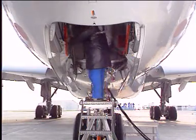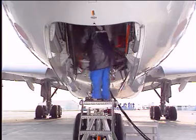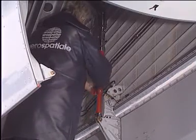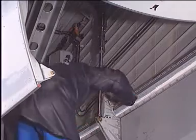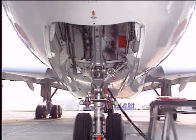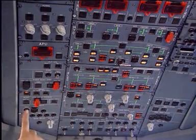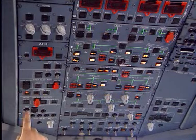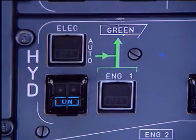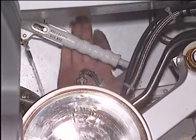Remove the safety sleeves from the door actuators. Make certain that the doors' travel ranges are cleared. In the cockpit, electrical external power on, horn activated, green hydraulic system pressurized, landing gear circuit breakers in. Replace ground door opening control handle in the closed position.